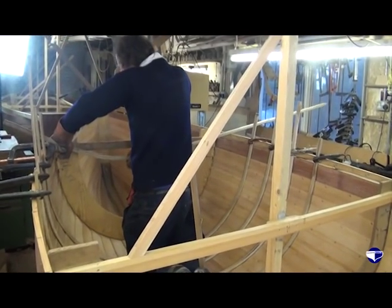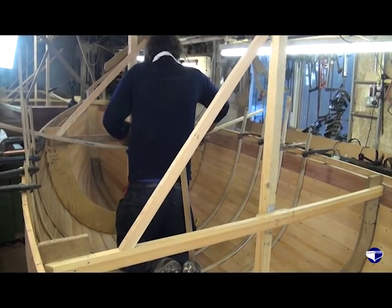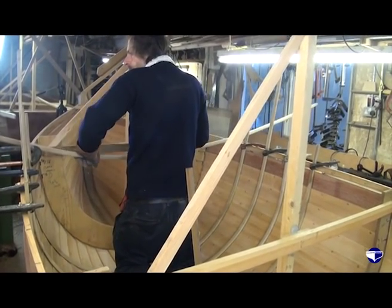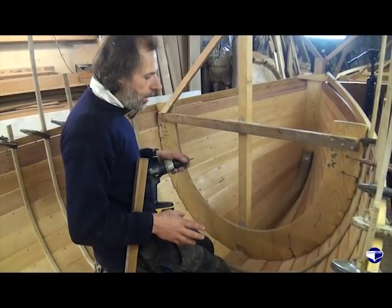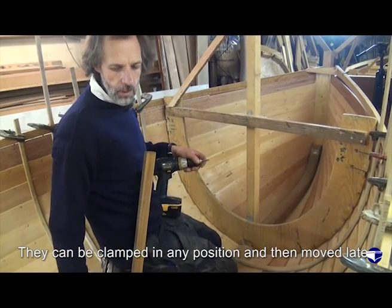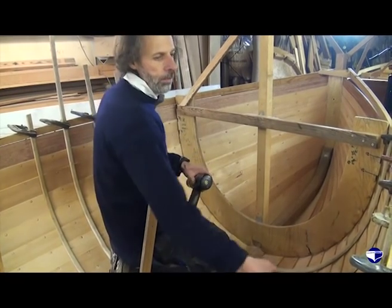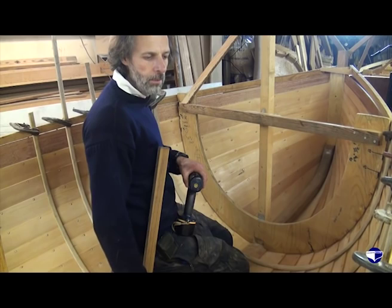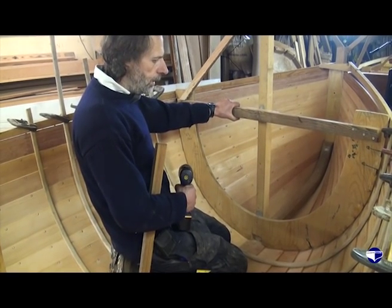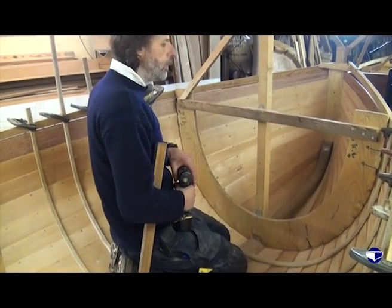Try to get a bit more edge bend on this one because we're coming into a more angled area of the boat, and getting the ribs lying flat on the planks is always good. The other good thing about clamping the ribs in is that we can clamp them somewhere other than their final position — I like to keep the molds in to keep the shape of the boat while I'm putting the ribs in. We can clamp a rib anywhere within reason so long as it's pretty close to where it's going to end up. It means we can leave this front mold in — we've got a rib that's actually going to end up sitting just an inch and a half ahead of this mold, which is tricky to get to at the moment.